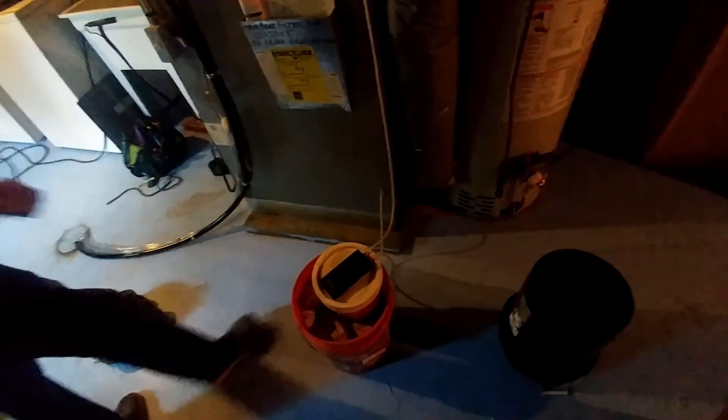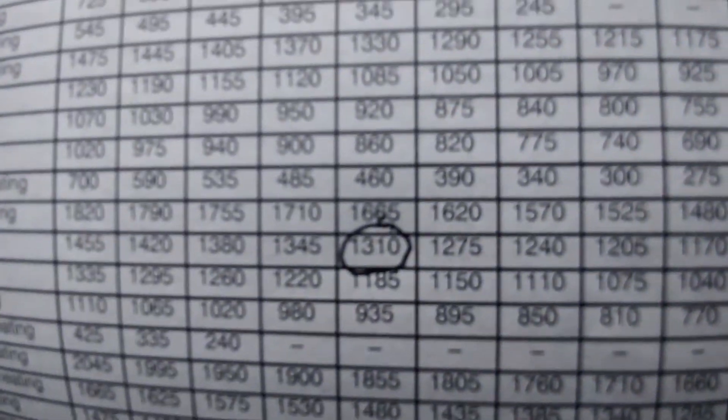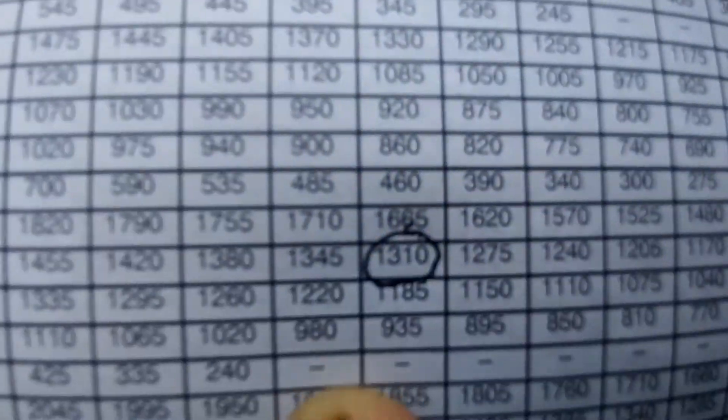It takes a while to get through the panel. I heard it click. Temp rise — what do we got for static? 0.57. We got a 33 degree rise of temp. 0.55. We set our cooling up for 1310 — that's the yellow wire. Blue is 1185. So heating's going to be down around 0.4 static. Cooling. So that's good. Perfect.